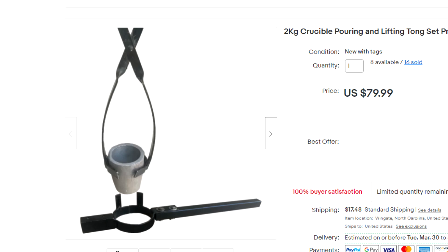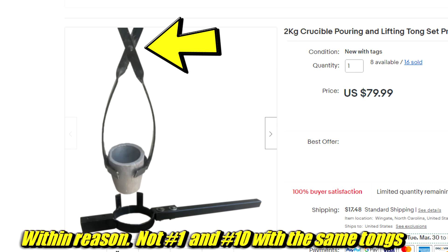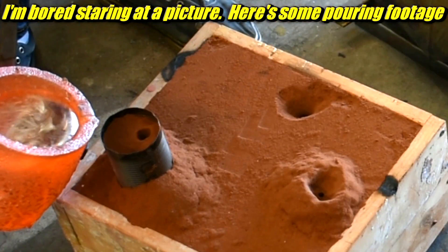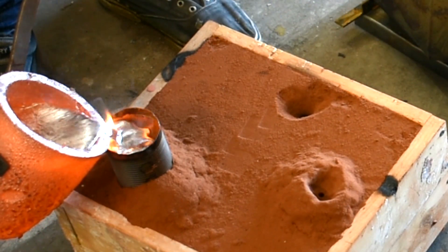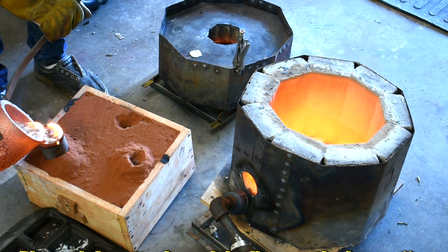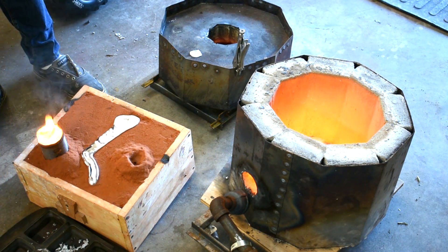There are a couple things I want to mention. Since the tongs open and close on a hinge, you can actually grab different crucible sizes. I have two larger crucibles that are slightly different sizes, so I want to be able to use the same contraption for both of them — which means a jaw that can open and close is a must. The shank, on the other hand, is like my current design — it's a set diameter, you can't just adjust it on the fly. If I have to adjust mine for two different size crucibles I actually have to bend the jaws, and that's not very fun.